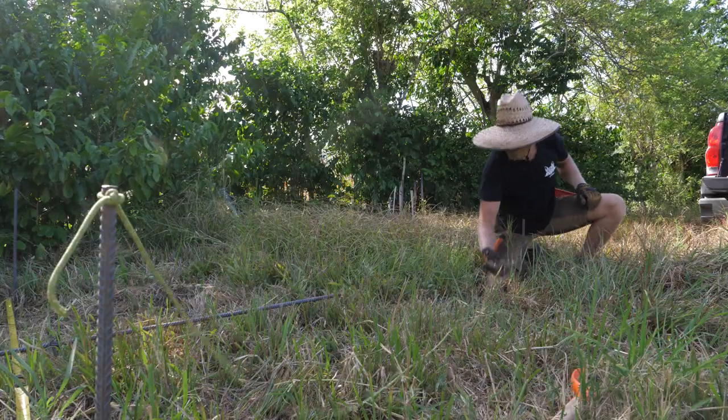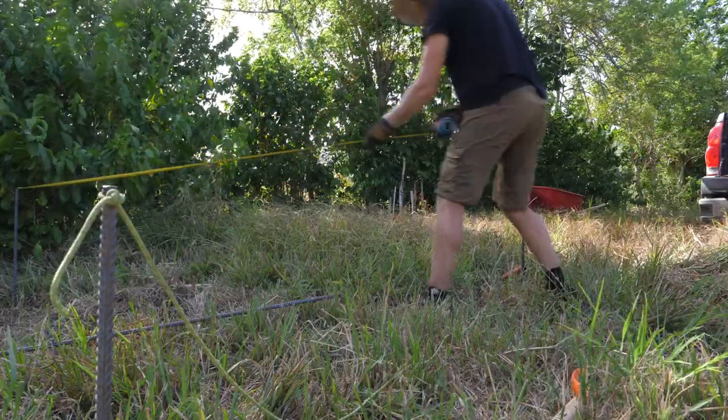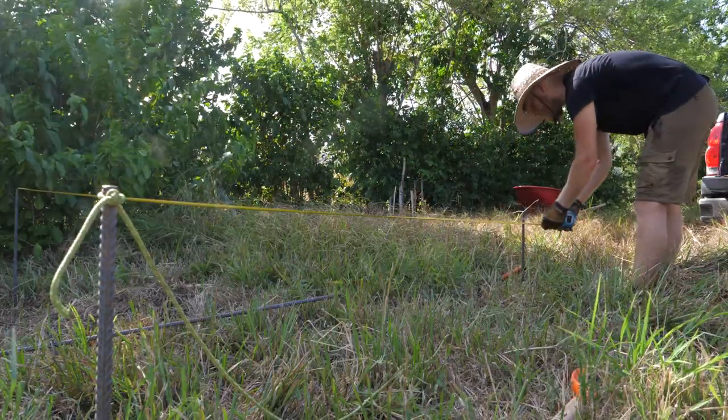The first milestone has been achieved. This was very straightforward and I'm very happy with how this went. For a few days I was thinking over what would be the best way to find exactly the points that I need to dig the holes for the foundation, and I found them. I measured them probably ten times so they must be good. Now I have a hexagon shape. What I'm now gonna do is dig the holes, measure again to see if I did the holes right, and then hopefully tomorrow I'll be able to pour some concrete. Let's get it digging.